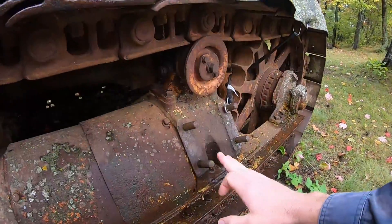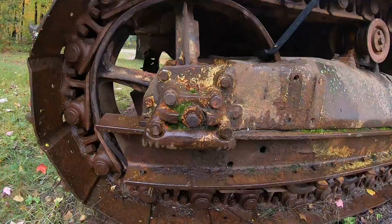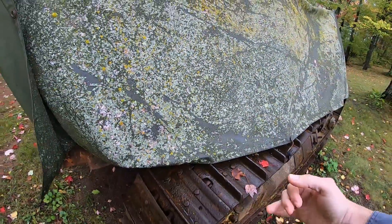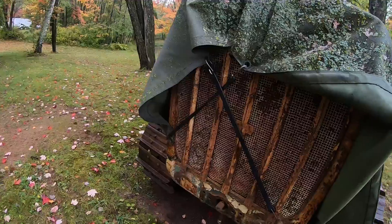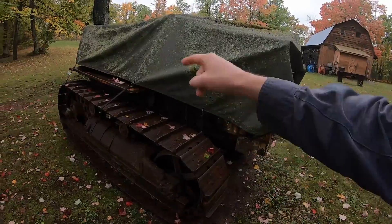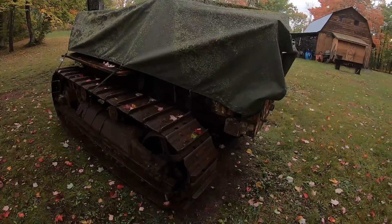Here are four of the old attaching studs for the trunnion bracket. We've got a lot of holes in the track frame up here where cylinder brackets actually surrounded the tracks right here, blocked you out of two thirds of the engine on each side, and housed — or I should say mounted — the cylinders. There was a control on the fender, a live power pump on the front with piping that went back. It's not on there anymore.